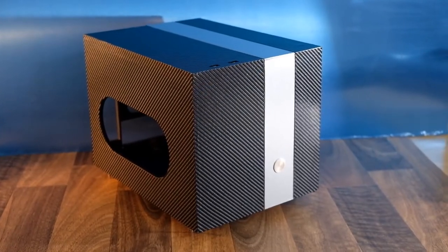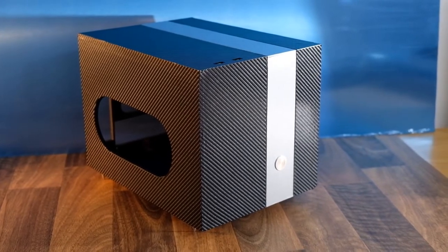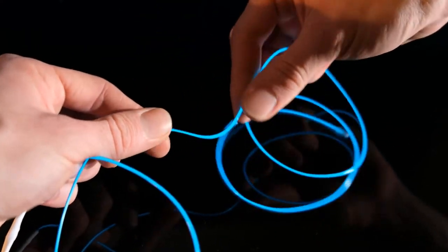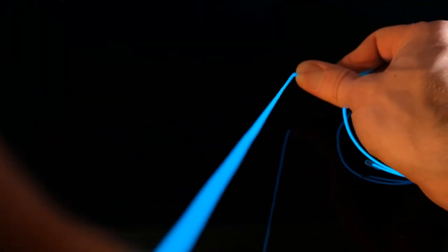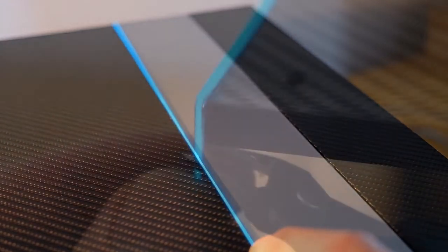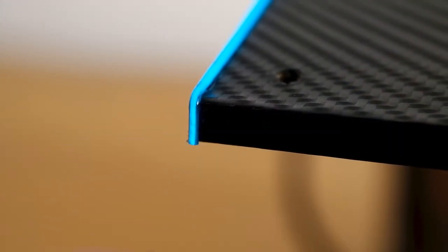To finish off the divide between the two vinyl textures, we have a few different options. If you want a simple, clean divide, you can insert a piece of wire or elastic into the gap. But we can do one better and make an awesome looking glowing rim by using some flexible electroluminescent wire, known as EL wire. This stuff is available in different colours and is surprisingly cheap — I've put a link to some in the description. Mounting it is just a case of using a small amount of glue to stick it onto the groove. Mine was slightly too large to fit fully inside, but that's okay as it actually looks better when slightly proud, as it can still be seen when viewed from the side. If you have any left over, it can just be cut down to size.